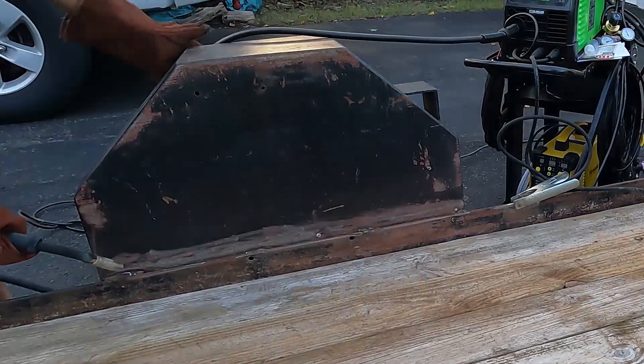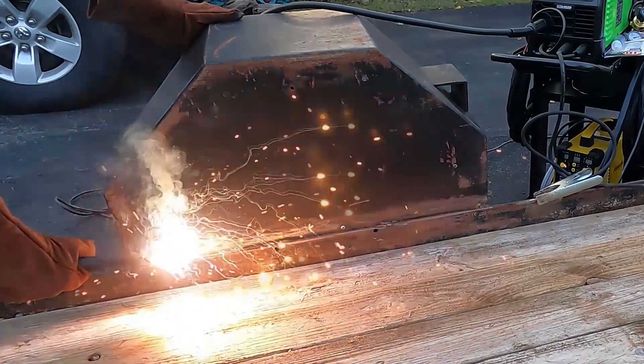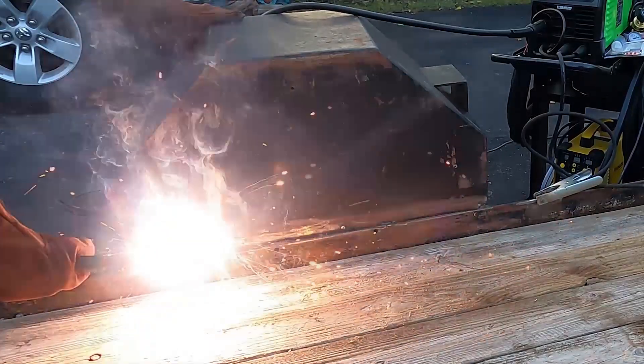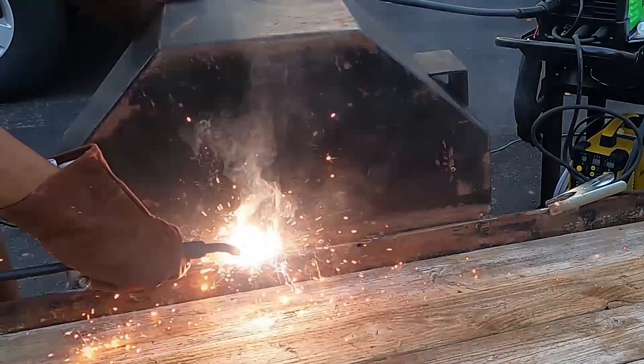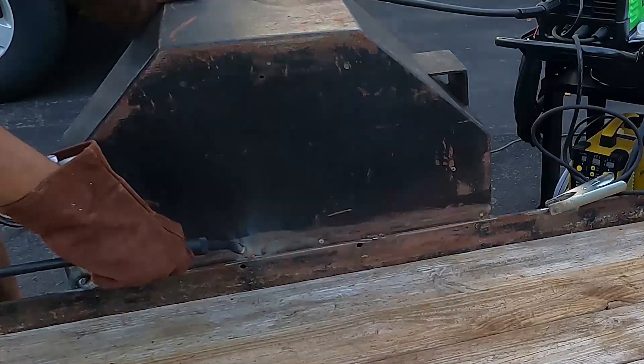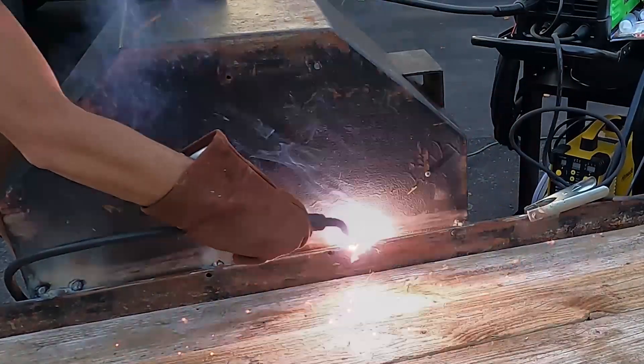You may remember my welder and my plasma cutter that I bought last winter — these things work incredible. I started the process by creating a bunch of stitch welds along these fenders. The fenders were only held on by one or two small bolts and were very wobbly, so I wanted to fix that and make them integral to the structure of the trailer.